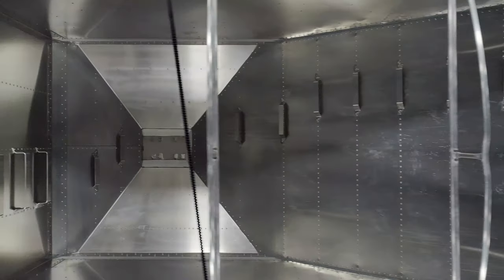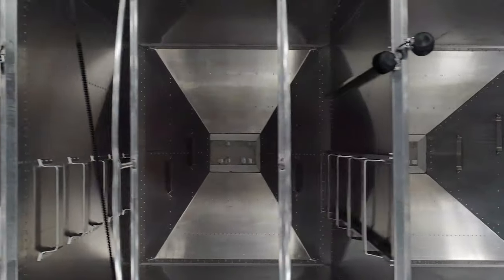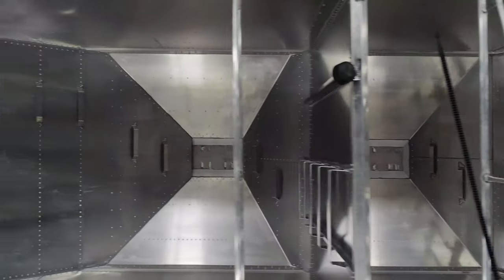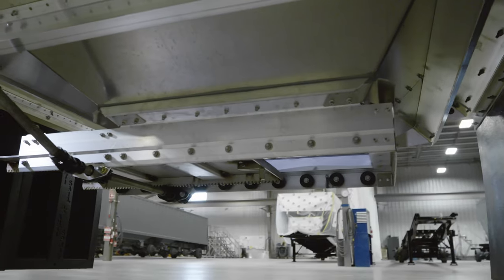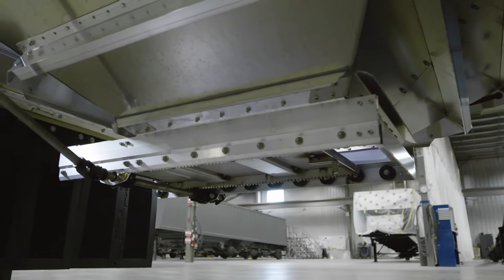It's split into three hoppers. The front and rear hoppers both carry 40 percent of the product and the center hopper carries 20 percent. All three hoppers drop their product through a 16 by 24 inch door, the same as we currently use in all of our different trailers. So it's a standard door opening, with the only difference being that there are three hoppers to unload.